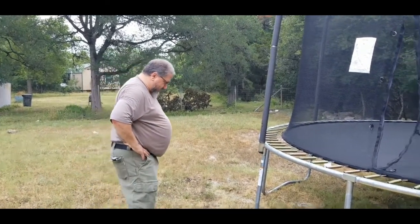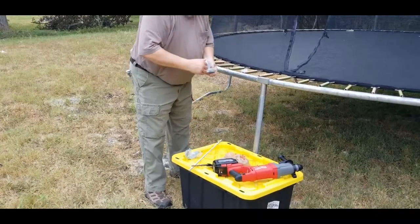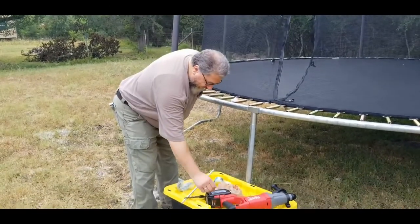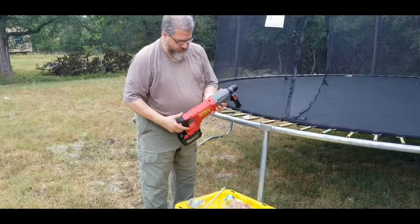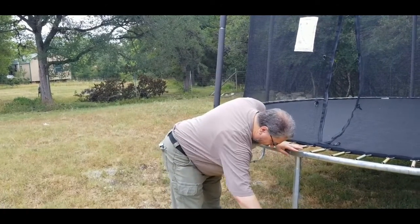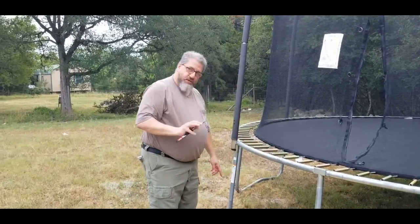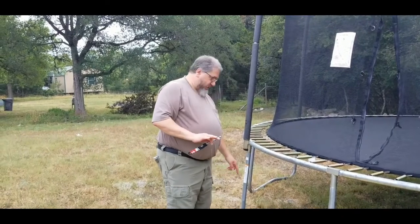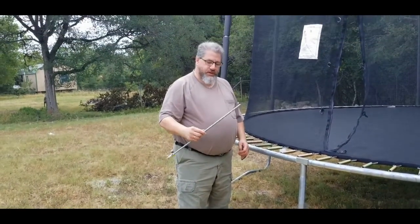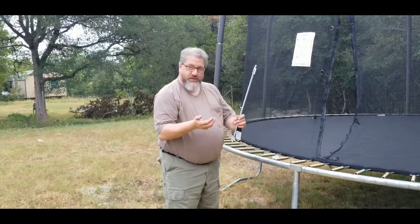Since in the hill country here everything is just a bunch of rocks, we're going to try to tie it down with these conduit clamps. I have my SDS Plus one-inch drill and a half-inch bit. I have anchors which I'll show you - we'll try to put them in the rock and then use all-thread to tie down the conduit straps, then a couple of nuts. Let's see if this works.